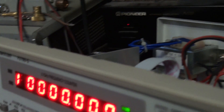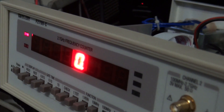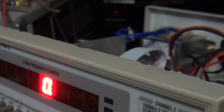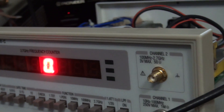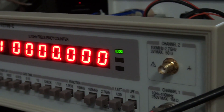I can show you that by just unplugging the UART from the computer. I'll unplug that now, and as you can see it's just dropped out — it's just showing one, zero. GPS board is off. Sometimes it drops to nothing at all, and other times it's just random digital noise. Just plug the UART back in again. And now just waiting on the GPS board — it's just locked in. There we go, locked up again.